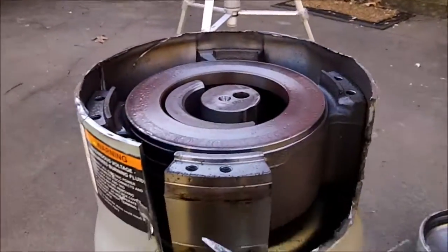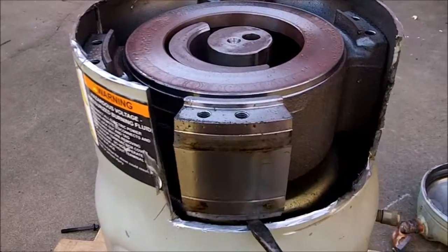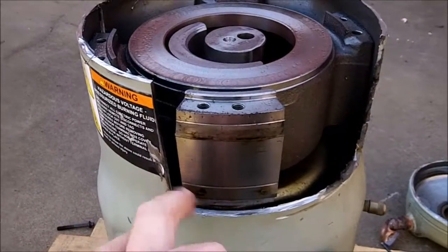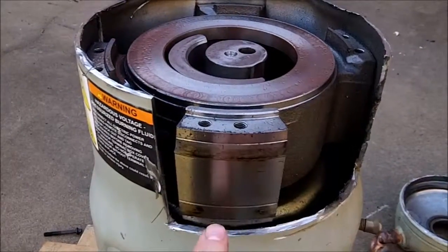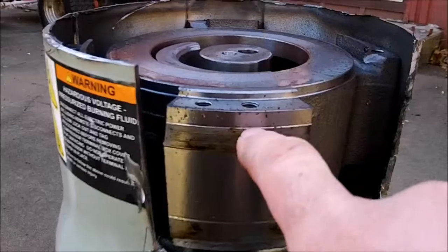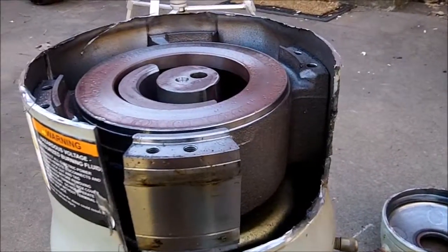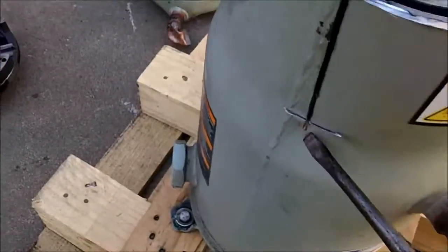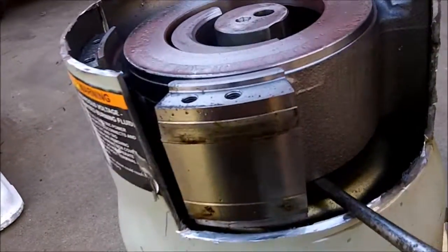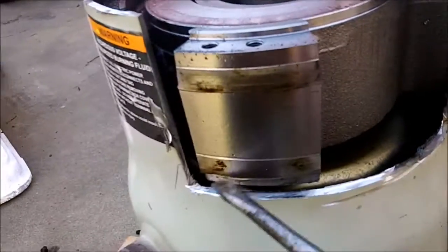Now I'll have to cut the side out right here to relieve the pressure on the sides of the main bottom half of the pump housing so I can pull it out. Unlike a Copeland scroll, which has holes that go all the way through the outer housing with four pins pressed in and welded around the outside, this one has wedges. When the housing is made you just use a hydraulic press to press the solid end in. To remove it and relieve the pressure, I have to cut that piece out — and that's the relief slit right there. Now you can see it comes right out. There you go — the pressure has been relieved and it's loosened from its housing. So pull that out and we'll have a closer look.